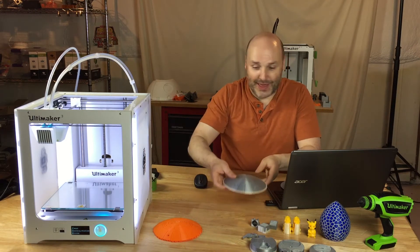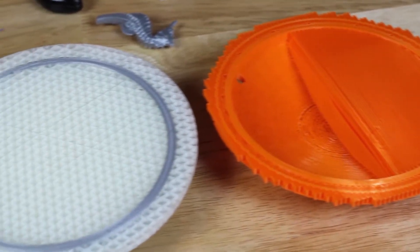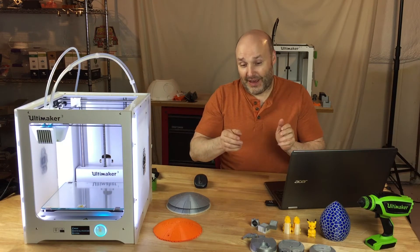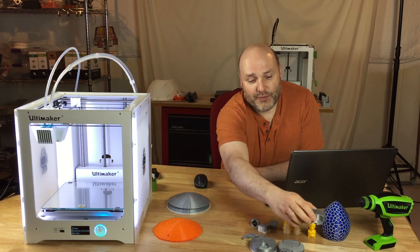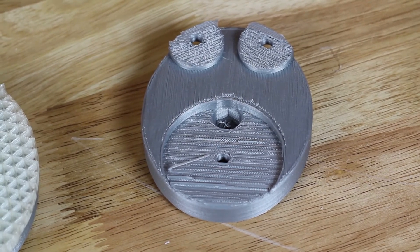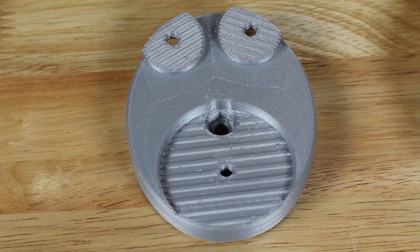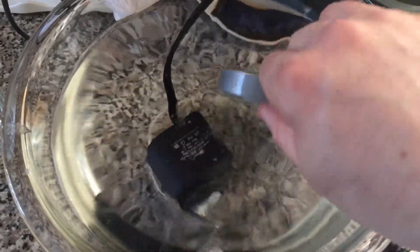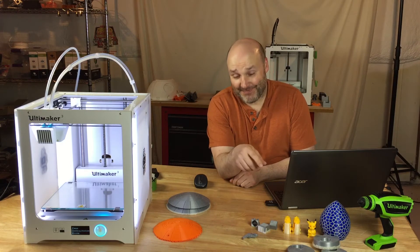I went into the Ultimaker 3 thinking this is probably not something I would use a lot, but after getting results like that — dunking it in water and seeing the finished result versus the cleanup I would have to do on the other part — it's really quite remarkable. There's definitely some pros to that PVA support structure. This other print is a mechanism inside the BB-8 head that holds the magnets. The part goes down like this when printed, so you have a lot of support material because it's slightly curved. Even with the best cleanup it came out kind of pooey. So we did it on the Ultimaker 3 with PVA support, and the finished result after sitting in water is baby smooth — no cleanup whatsoever. You throw it in water, come back in eight hours, and it's all taken care of.